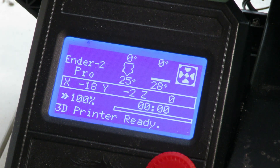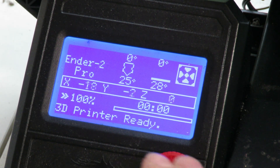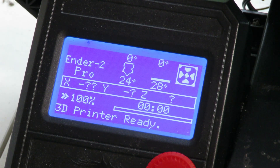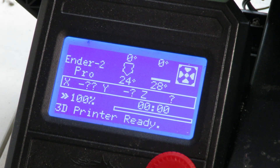With the advancement of BL Touch and automatic bed levelling, they kind of got rid of that in the lower end printers to force you into the higher end printers. But I will always love manual bed levelling because it cannot go wrong — you just tune it every now and then. There's no software that breaks, which has happened to us in the past with automatic bed levelling. A lot of people don't like manual bed levelling because it is a bit of an art, but once you know what you're doing it's a lot simpler.